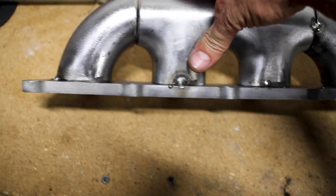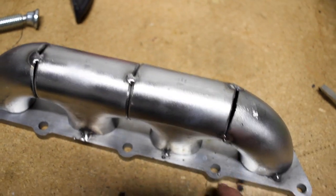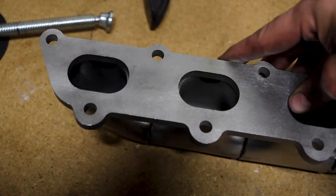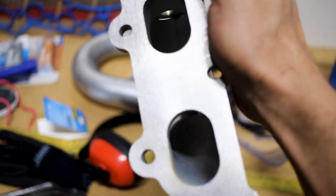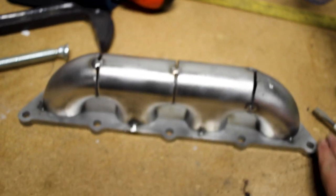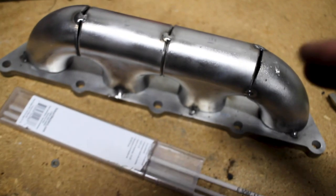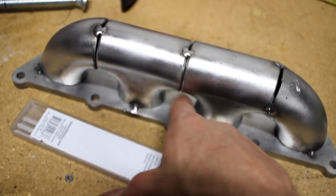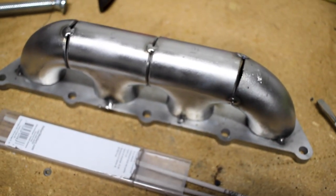I got it all tack welded up. I got a little carried away with the gap here, so I'll have to fill that in, but it shouldn't be too bad. One thing about welding is that metal tends to shrink as you weld, and you can see how some of this stuff shrunk up a little bit — things kind of shifted. I know I'm going to have to machine this because it's a little warped, which is fine. I only have about four more welding rods left — I used one rod to tack all this up. I'll start at the base because those are the most flush, and I'm going to have to get some more rods. This is all I could find at Tractor Supply.